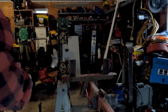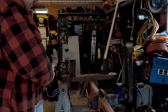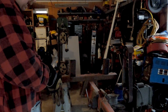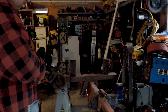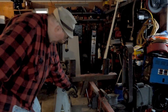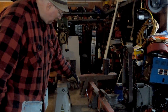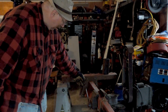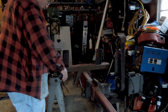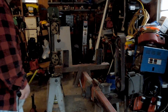To my mind, one of the big advantages to power tools, especially something like this power saw, is that it can work semi-unattended. You have to watch it and make sure that everything's working okay, but it will start a cut and continue cutting all the way through. So I need two spacers, one for either side of this, because if I don't have a spacer in there, when this thing starts getting a load on it, it's going to pinch that front end shut and bend that plate. So I need to cut this box tube two and a half inches.